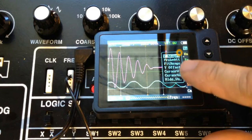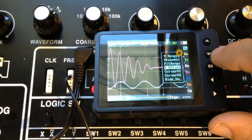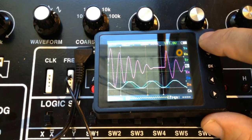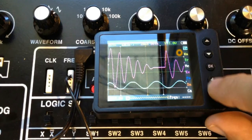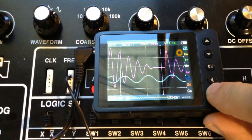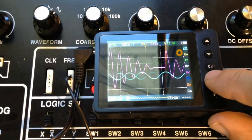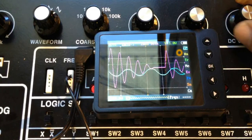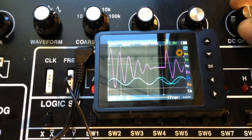The waveform is a little low on the scope; I'd like to bring it up toward the middle. Let's go back into the YN selection and do a Y offset adjustment. Select Y offset, then use the left and right arrows to raise it up. You can see the zero-volt line showing up right here at the top. I can change the DC offset to bring it up or move it down to the bottom, positioning it right about the middle — which is probably where we want it.